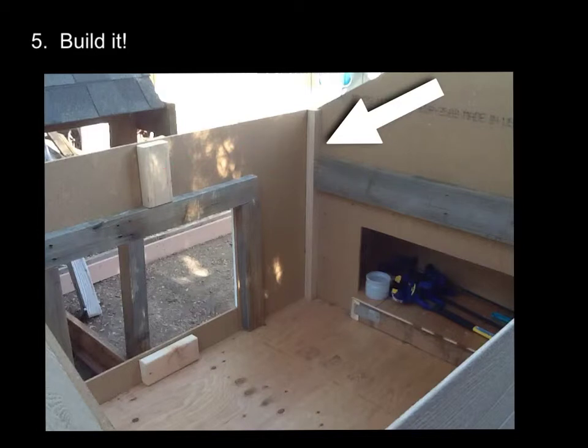That hot air is going to rise and escape out of there and keep things nice and fresh for your birds. The plans in his book just required plywood on these walls, and I went with an exterior wall to help give it a little bit more protection, but it's also not as stable. So I actually put some two-by-twos up on the inside in every corner. And then as you can see, I reinforced all the openings with two-by-fours to make sure that when I set things down, this whole place would not buckle.